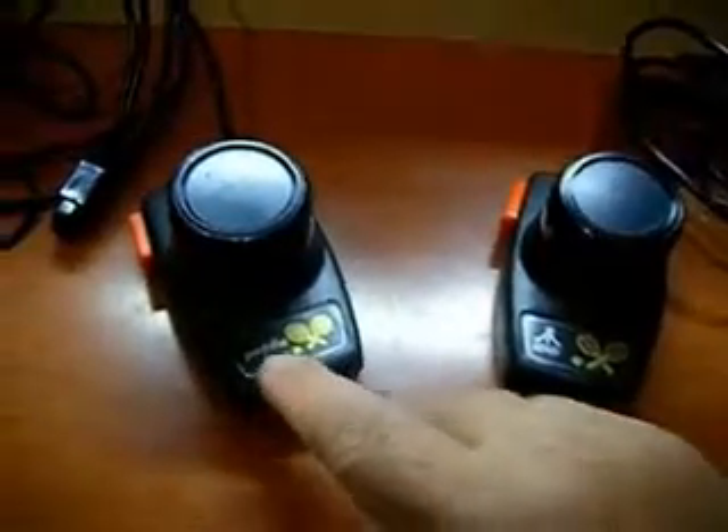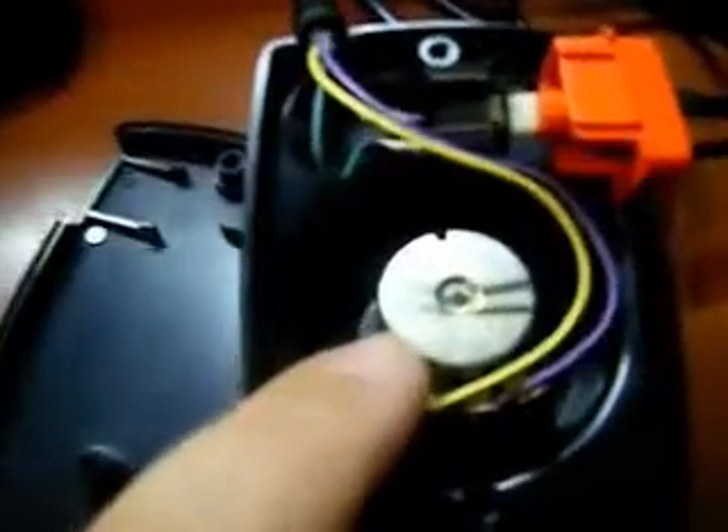This is the standard paddle that came with the Atari's afterwards. Internally, the paddle controllers look very similar. The only real difference between the two controllers is the pots that were used inside. They were both one meg pots; however, the heavy sixer potentiometer used a better quality pot than what came afterwards in the standard Atari paddle controller.